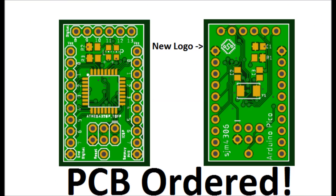Hey there YouTube, this is SGM4306 back with another very short quick update video on the wireless Bluetooth controller series I've been making for my NES and SNES Classic. Here you can see I've already designed up the PCBs — this is a general purpose PCB I designed for prototyping with the ATmega328P, commonly found in the Arduino Uno and Pro Mini series. I designed this to use across multiple projects rather than making a custom board just for this one.